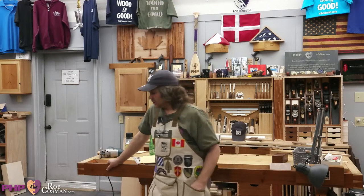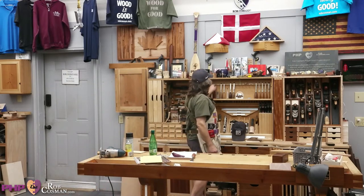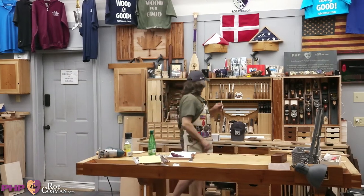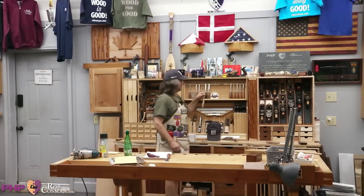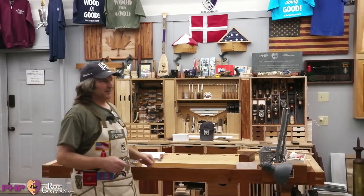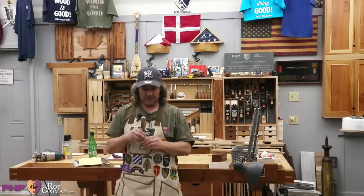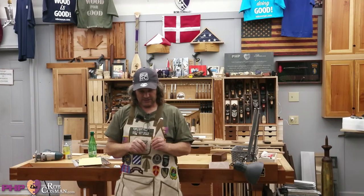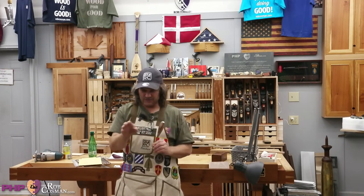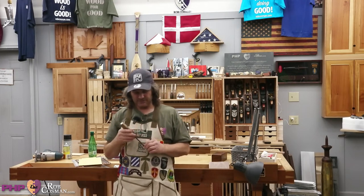When sharpening a 17-degree chisel, do you put a secondary bevel on it? Yeah, secondary and tertiary. Just in case you don't know what he's talking about, when I deal with really soft woods, meaning pine, alder, aspen, basswood, poplar, they have a tendency to crush when you're chopping in between your pins or your tails. And when they crush, big chunks of wood come out and it leaves a big hole, usually really close to the surface. Also almost makes it translucent when you finish the joint.